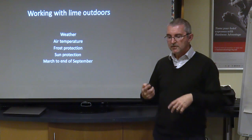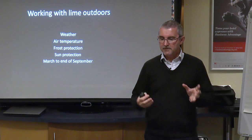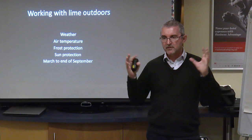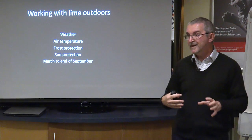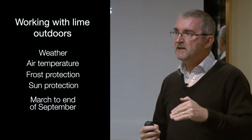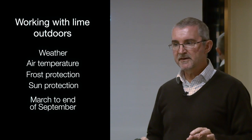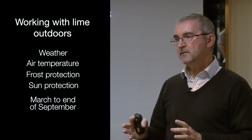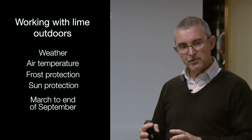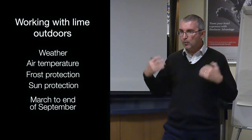So just to bring it all to a conclusion then, working with lime outdoors is really something to be done during the spring and summer. It's not something to be done this time of year in the winter time, certainly between, let's say, middle October, end of October at the very latest, through to about Easter. And it's absolutely fine to work outdoors during those periods, but only if you take adequate precautions to protect your lime against the overnight air temperatures. It doesn't matter if it's raining, it can get wet, that's absolutely fine. It's the temperature which is the critical factor.